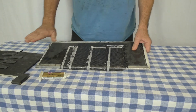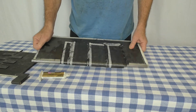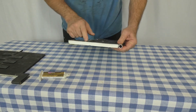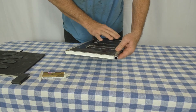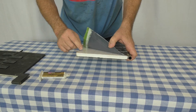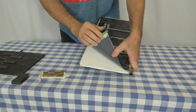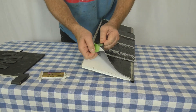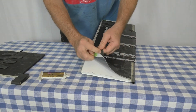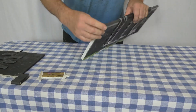In the case I just showed you, I'm testing the lug attachment to the panels and the panels themselves. These components will be used for just testing the strength of the lugs. I have a half-inch inside diameter 4130 chrome moly tube here attached to the carbon fiber components that actually form the lugs themselves. What I've done here is I have a half-inch thick piece of foam core, covered with packing tape. The first layer is two-ounce carbon fiber, and on the inside there's a layer of peel ply underneath to leave a rough surface for bonding these lugs onto the test fixture.